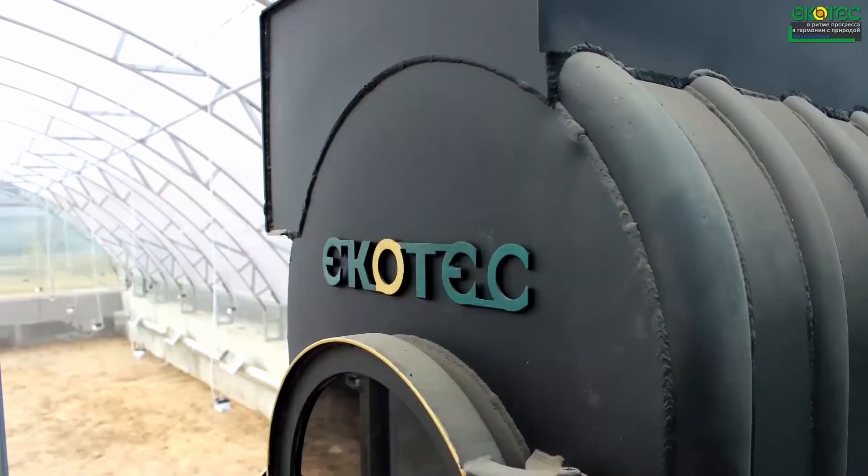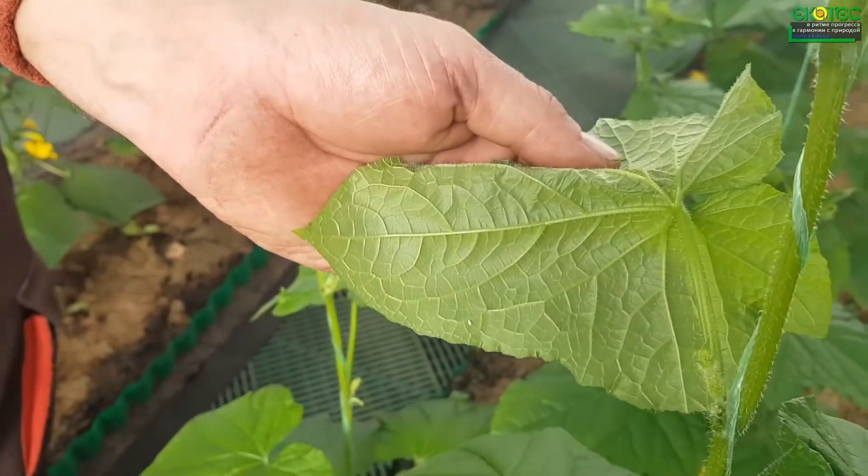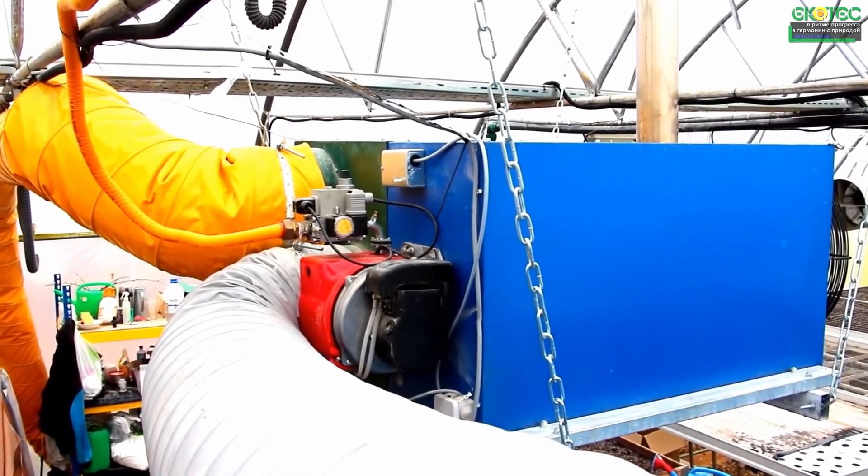Another important factor is the cost of the systems — air heating is much cheaper than water heating, and the boiler with a redistribution system is also cheaper. Fourthly, this system is not afraid of thawing and freezing. For example, if the greenhouse is not working, we can mothball it. There is no need to drain the water or fill it with antifreeze — we just close it and seal it up. This often happens when it is necessary to destroy a whitefly infestation. Usually everything is opened so that the pest freezes. If we have water heating, it is recommended to drain all the water to keep it from freezing. With air heating it's easier — we turned it off, it stopped working; frost or no frost, we turn it back on and it starts working again.